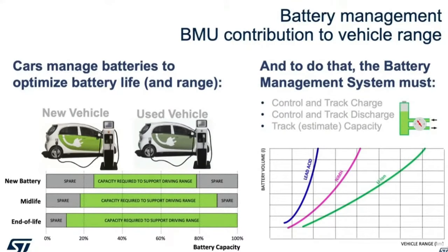The challenge with these batteries is that the energy density is very high, so you have to safely charge and discharge them, and also manage battery life. When batteries are fresh they have huge capacity, which slowly decreases over time. You don't want users to think they have more capacity than they've got, and you don't want to overcharge the battery. You actually charge the battery differently based on its aging, and that's one of the things the battery management system helps with.